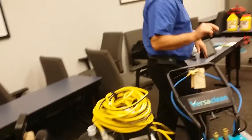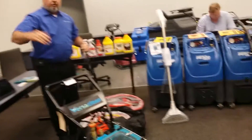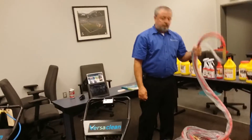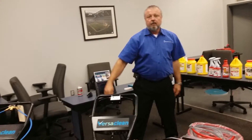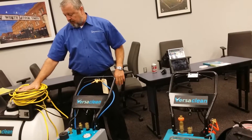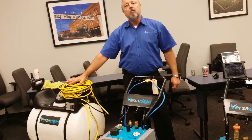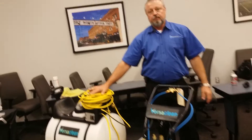The first 50 feet has the electrical power cord built in. Any additional sections up to 200 feet just carry your fresh water and wastewater lines — no additional electrical needed. So you can hook them up in 50-foot increments up to 200 feet away, giving you the ability to clean commercially where a truck mount won't go or a portable is just not effective — high-rise, high-security, wherever.